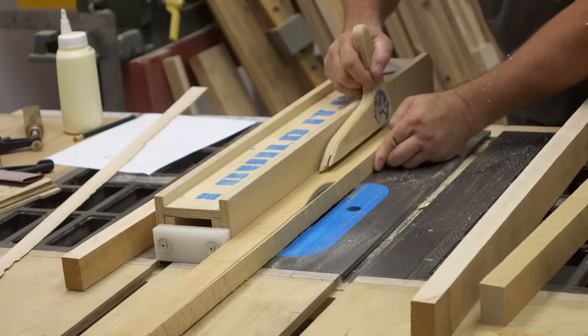Next I want to make a squaring cut on one side. I've reset my fence to fifteen sixteenths and raised my blade so I can make that cut in one pass on the inch and a half wide pieces. On the two inch piece I'll cut that in two passes. Then I'll reset the fence to thirteen sixteenths, which gives me enough material to plane off. What I want to wind up with is stock that's exactly three quarters of an inch thick.